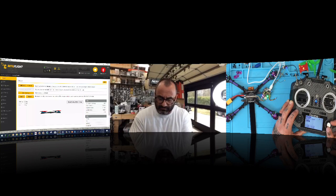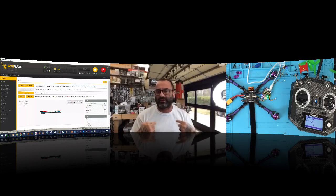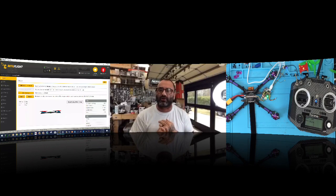There it is. Now watch, if I put those, for example, a whole page down, there it is. I see my RSSI and I see my battery that's being fed. So that information is being sent back down, which is perfect, and that's what I wanted. Hopefully, guys, that helps. That's how you're going to set up your telemetry on your RXSR, and almost all FrSky receivers, there is an uninverted pad somewhere on the board.